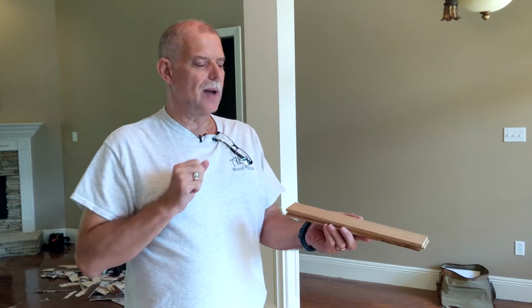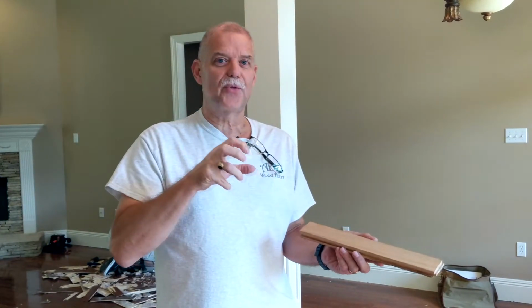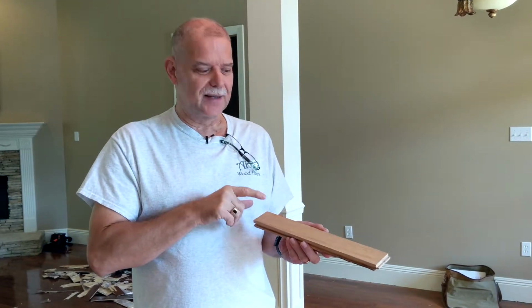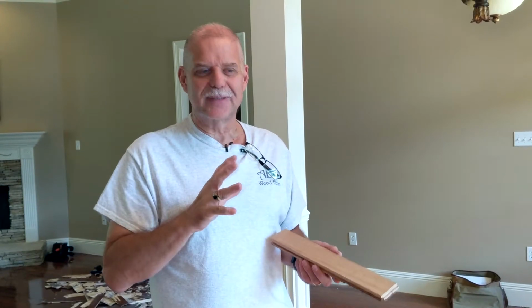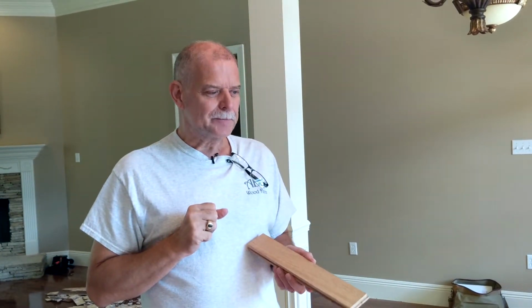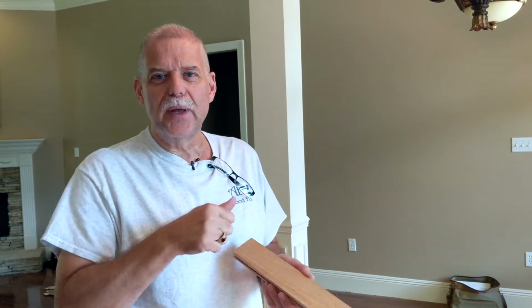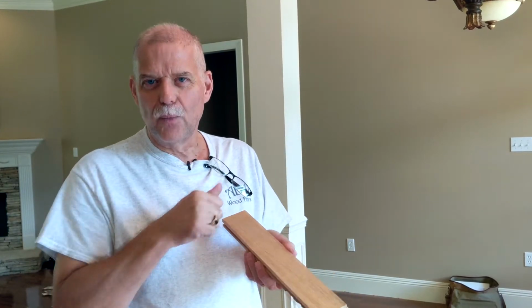And we pulled off the job and waited 6 months. Now the air conditioner began to dry out the floor. So he called me the next day after we sanded it and said, my floor is popping. It's making popping, cracking noises. That's the air conditioner drawing the water out. We came back 6 months later. The moisture content was normal. All the numbers were good in the floor and the subfloor. We sanded, finished it. We did a little repair, $7,000 instead of $35,000, because this floor will last.